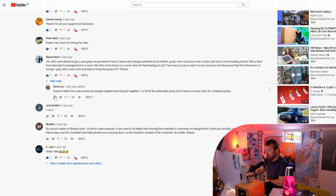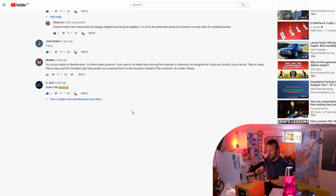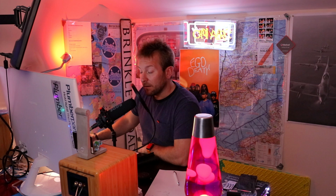Jack Hoskins went in there and said, why? No, why? All right, mate, there we go. Boom. Do not put solder on flexible wires. Tin flows under pressure. If you want to do better than shoving fine stranded in a terminal not designed for it, and you should, use a ferrule. They're cheap, they're easy, and they're insulated. Type help prevent you screwing down the insulation instead of the conductor. No solder, please. All right, mate.